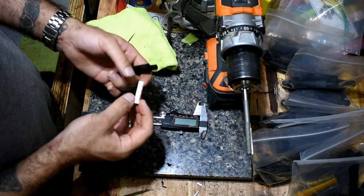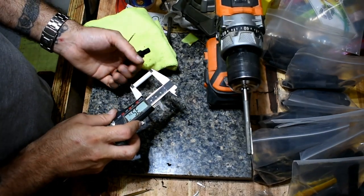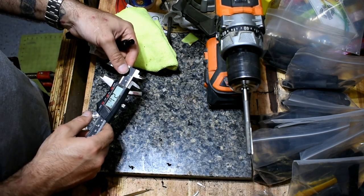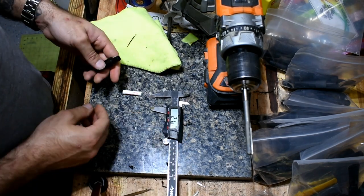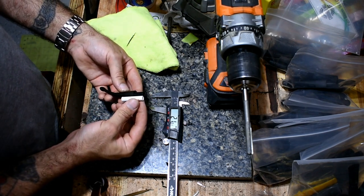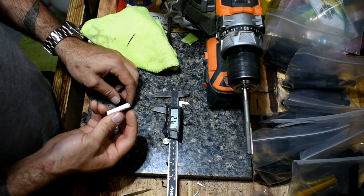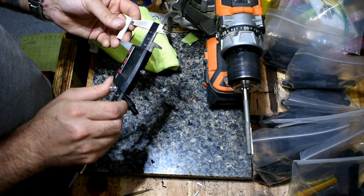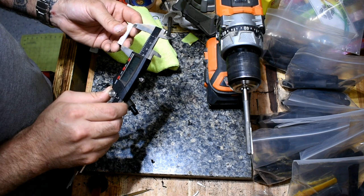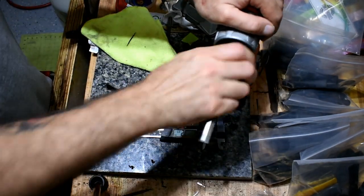These Vauen filters are 35 millimeters long. The pocket I have created so far is 21 millimeters deep, so I'm going to continue through — there seems to be more than enough depth here. It should stick out a little bit so you can at least hold it. There's enough girth on this stem to facilitate deepening the hole. I'm going to do some quick calculation: leaving a couple of millimeters, I'll shoot for 32 millimeters depth. Go ahead and tighten that down and get the last drill bit I used.